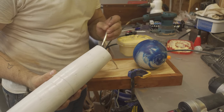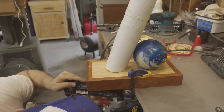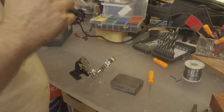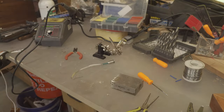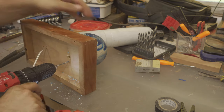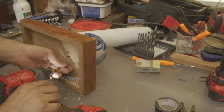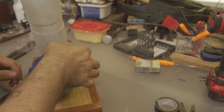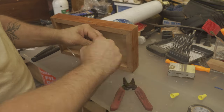I apply wood glue to the base of the pin and then fire a couple of 1 inch and 2 inch brad nails in from underneath. It's time to wire this thing. I solder the connections to the switch and wrap them in heat shrink tubing and electrical tape. For some insurance, I drive a couple of number 8 screws into the bowling ball. I then wire the lamp connections into the switch as well as the power cord.